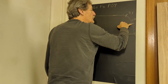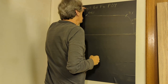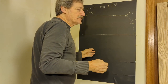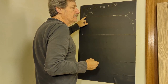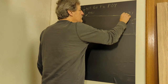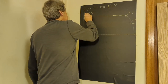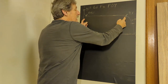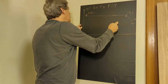So he said at 3.1, you could go as low as 3.0. It makes no sense to go to 2.55 because you're stressing out your batteries, just like it's no sense to go up to 3.65. So this has nothing to do with 80%, 20% charging. At 3.4 volts, you're about 95% capacity of the battery. And then this here really doesn't matter because it falls off so quickly, you're really not getting anything, so why damage your battery? So this is the area that you're really looking to use as the part of the battery that you're going to charge and discharge constantly. Okay.